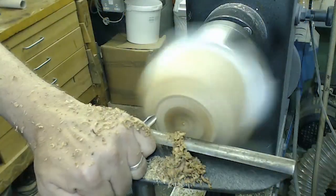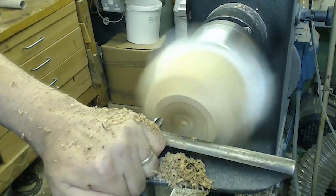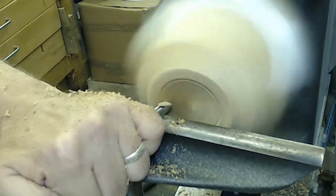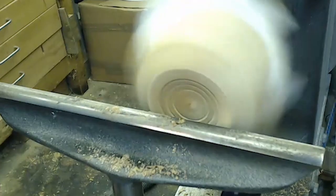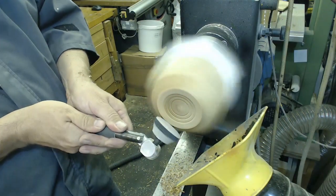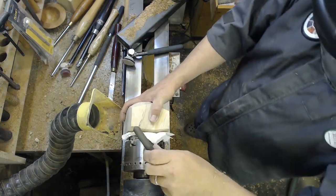A little ogee shape it ended up being, and then cutting across the bottom. I want to hollow the bottom slightly just so that it's got an outer rim to sit on so it will sit squarely. I'm using a little spindle gouge and then one of Les Thorne's round skews, just putting some little lines in the bottom - a little bit of decoration, nothing too fancy. This is a piece where the wood really speaks for itself. You can see the lovely spalted figuring in the wood. Most of the sanding I'll do by hand because obviously I don't want that square bit of wood bashing my knuckles - it was actually quite therapeutic doing a little bit of hand sanding.